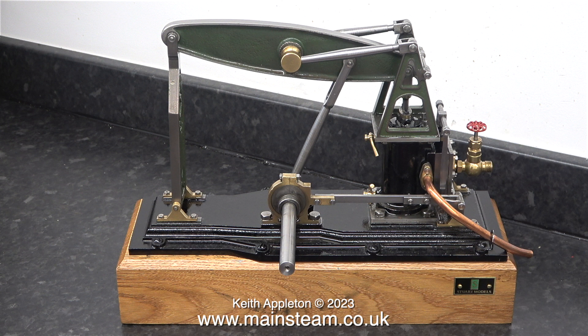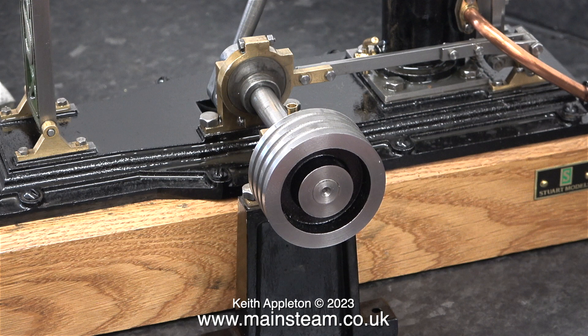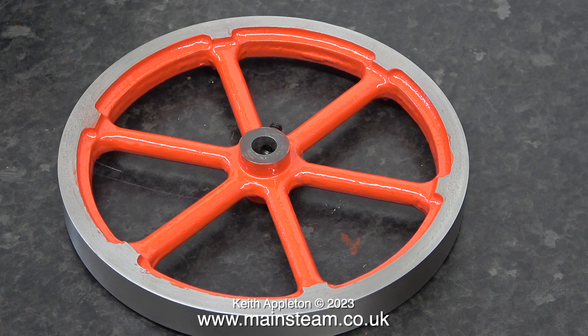It was bought as a machine kit. Overall the machining quality of this kit was of a very high standard, and it would have been fine if the man who assembled it hadn't drilled out the flywheel, which then became a rattle fit on the crankshaft. The bush had been fitted and was also very loose. This is the flywheel after I bored out the center, rebushed it properly, and fitted one M6 grub screw instead of the two 2BA slot-headed grub screws.